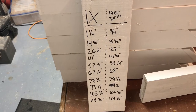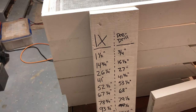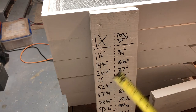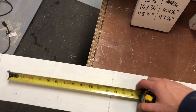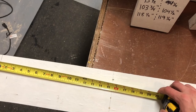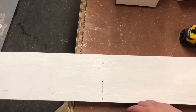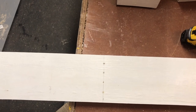The second column of data shows you where to pre-drill. Take the workpiece and turn it over on its side. For example, at 15½ inches — starting from left to right, find 15½ on the tape. This is where I'm going to pre-drill four holes, which will make assembly a lot easier.